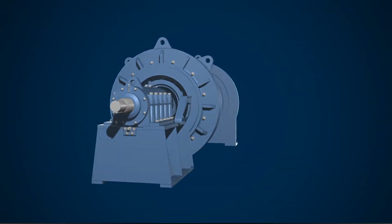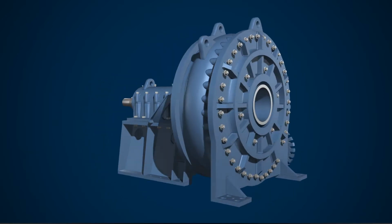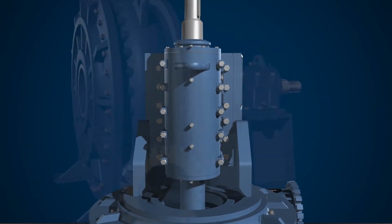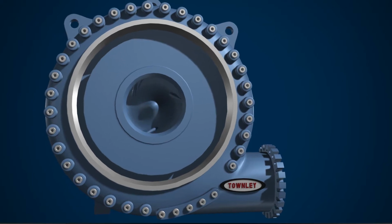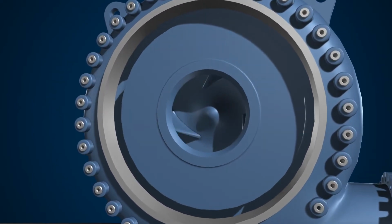Now we can design a pump to maximize the efficiency for a longer period of time by shaping it properly to where the wear rate of the vanes, for example, and the cutwater are reduced, so the efficiency can stay up over a longer period of time, and that in the end will result in sustained power savings to the customer, which lowers the overall cost per ton.